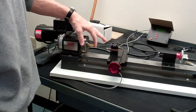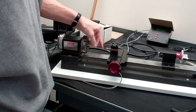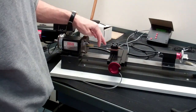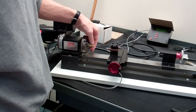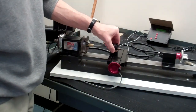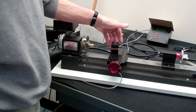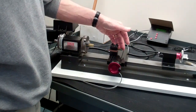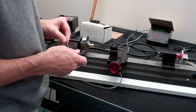This piece was just cut off from a longer rod with a hacksaw, so the end is kind of rough. The first thing I'm going to do is a facing operation to clean up that end and give it a nice finish. I have my two-tool post in the cross slide with a right-hand tool and a left-hand tool. I'm going to use the left-hand tool to cut across the face, so I'm going to bring that one into play like this.